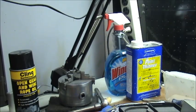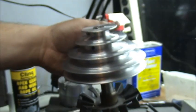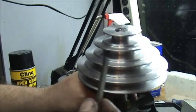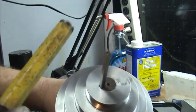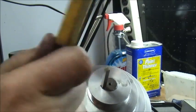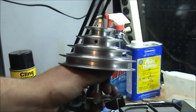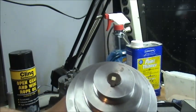Let's see if I can slide it on the shaft here. The motor isn't together yet — I'm just waiting for some bearings to come in. But here's your key seat. And here's my key — well, this is just a piece of high speed steel, I still need to pick up a regular key for it. But it fits right in there, taps right in. The key is lined up right with that set screw, so there's no chance of this torquing itself off for any reason.